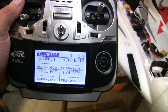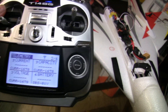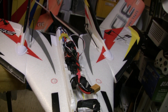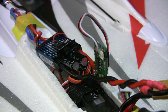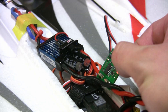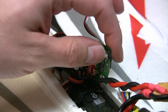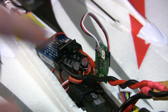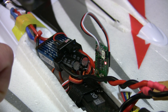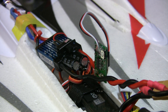At the moment the fuel gauge is not set up for slot 3, so I will change that after I power up the fuel gauge. As explained before, if I push the setup button while powering on the system, the fuel gauge will enter setup mode. Right now it is on slot 1 and I need it on slot 3, so I will push 1, 2, 3 times — and it shows me 3 blinks. I hold the button to confirm, see the confirmation blinking, and now it is ready for uplinking.